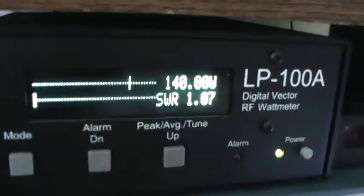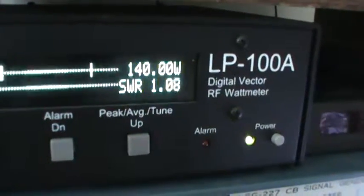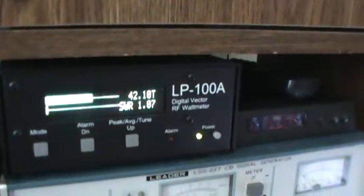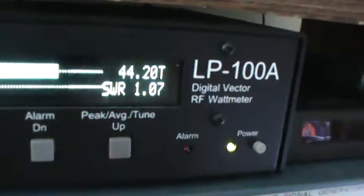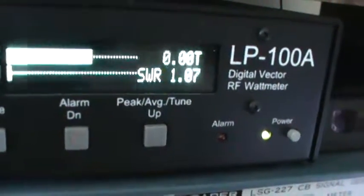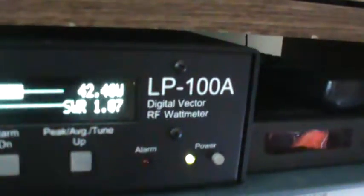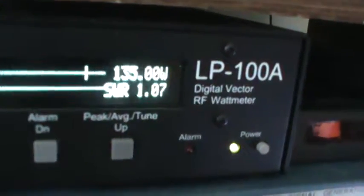There's AM. Audio, check, check. 140 watts. 140 watts on AM on the swing. Awesome. Okay. I got the mic gain kicked up on the mic so you can see it's picking me up. And 40 watts. 40 watts dead key, swinging 140. Put it back on, there you go, peak. Audio, check, check. Hello, audio. Yeah, that's good. That's real good.